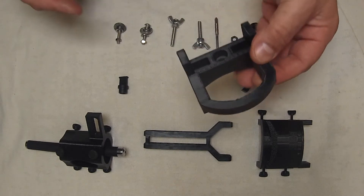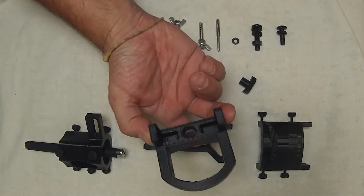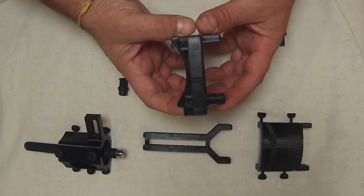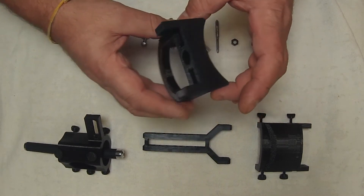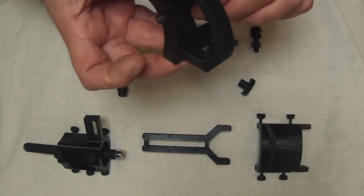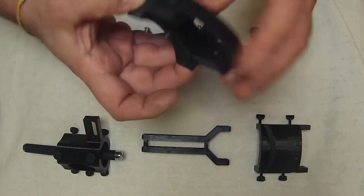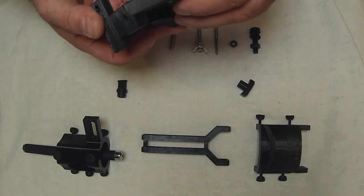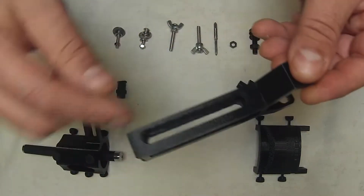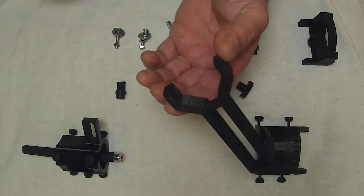Starting with an azimuth adjuster with a bridge over it, so it's very strong. This is based on somebody else's model, but it wasn't strong enough in my opinion — if you over-tightened the tightening bolts, they would break. So I built a bridge on it. You should print these with a high infill — 90 to 99 percent — to make them super strong. They should all print in the right orientation, but this one you could adjust different ways for your own needs.